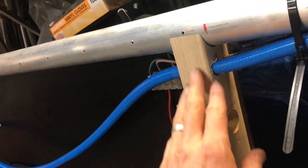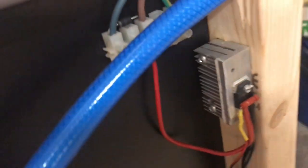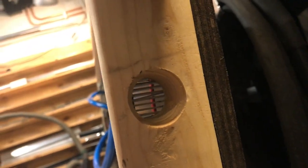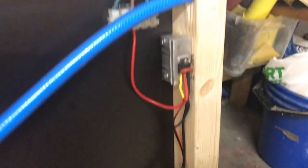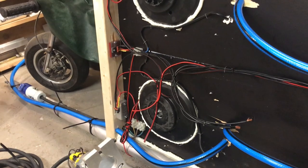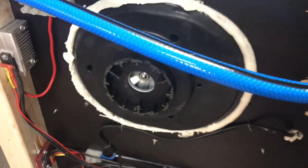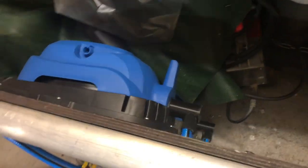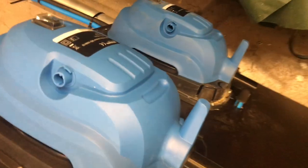The wood here hasn't had any surface layer applied yet. And here is the somewhat sketchy electronics. The vacuum cleaners suck air through holes here, forcing air to pass through the cooling fins. It's symmetric — one in each quadrant of the vehicle. On the aft of the vehicle I have an extra transistor controlling power to the two vacuum cleaners, which are slightly modified and hacked to do the job of inflating the wheels. On the outside it looks a bit prettier, with a 3D printed part that splits the outgoing air to the four hoses, all controlled in parallel.